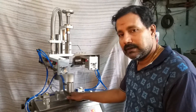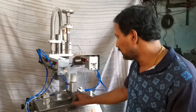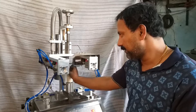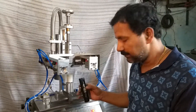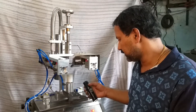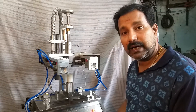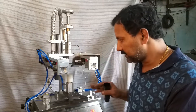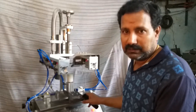When the tube holder slide moves to the right side, the tube is cut to level. The finished tube can be removed and a new filled tube has to be placed. The temperature has already reached 480 degrees, which is the preset temperature. The air pressure connection is on and we can start the machine.